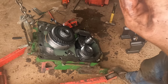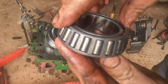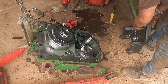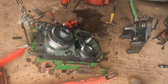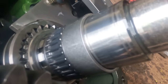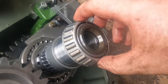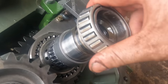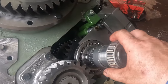that bearing has definitely spun on that shaft. And there's rough spots in it as well. I think you can see, but obviously there's a bit of grit in that now. Something is not right on that bottom shaft. I don't know if you saw properly just then, but that there is really not. Well, you think when that thing's got horsepowers going through it, there isn't a lot holding that on there, is there? Or stopping this from spinning on there. And the bearing's a bit rough anyway.